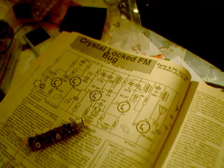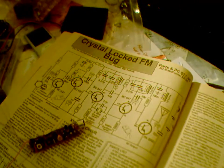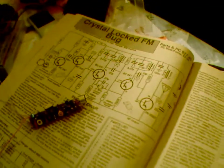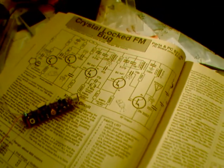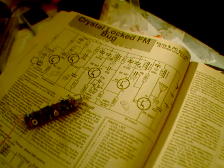PD4Z, for self-builders: don't you find the use of switching transistors less than friendly within the narrow linear region? Yes, they are very critical. When you adjust the bias, it's a very narrow range of settings, and if you've got it too high, then it takes off and gets hot and blows up, and bang.